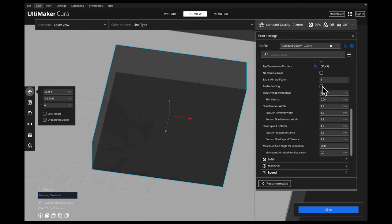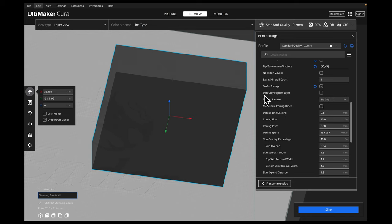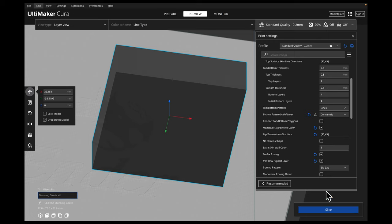There's another setting I think is really important, especially for those trying to get a really smooth top layer, and that is ironing. What ironing does is it 3D prints your entire top layer, and then when it's done with that last layer, the nozzle moves back across your actual print to help smooth it out — because it's keeping the nozzle hot. That hot nozzle is just smoothing it out. Let me show you what those settings are in Cura. So now let's go to enable ironing. One thing is we can iron only the highest layer, which I actually do because it saves print time. For our ironing pattern, we have zigzag and concentric. Let's leave it on zigzag and I'll show you what it looks like.